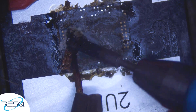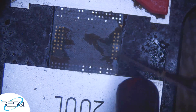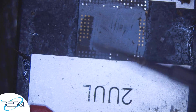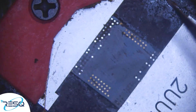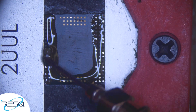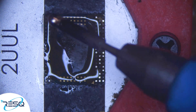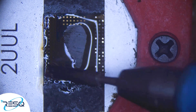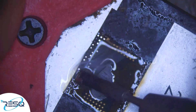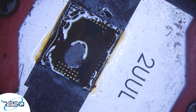Don't overheat the chip, don't scrape or scratch, and don't damage the surface — that's always very important. After cleaning, use some hot air and a plate to remove the rest of the glue. Then apply flux and solder down the pads so they are shiny and not gray, because otherwise you won't get a good connection to the socket and you won't be able to read it.